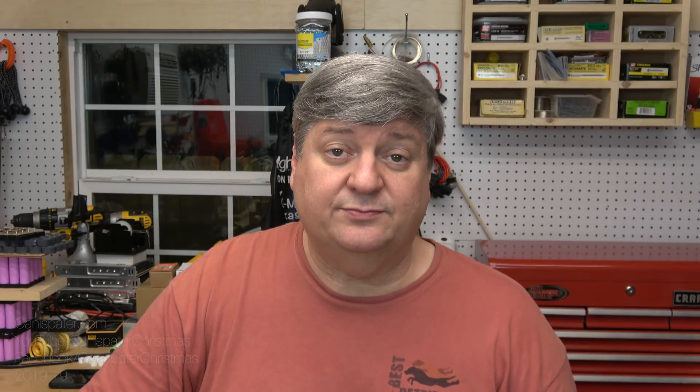So we need a way to monitor not only the voltage of the entire battery, but also the individual cells or cell packs to make sure that all the packs get fully charged but not overcharged. The manual way to do this would be to charge each cell pack individually, but that's really impractical. A battery monitoring system can monitor each cell pack to keep track of voltage, and can alert you if one of the cell packs gets too high during a charge or too low during a discharge. However, a battery monitoring system doesn't prevent a catastrophic failure on its own.